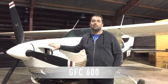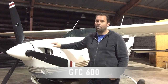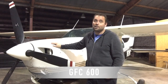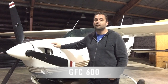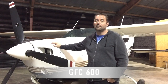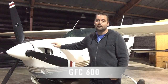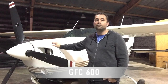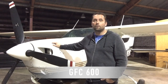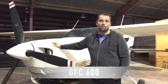The Garmin GFC 600 is their flagship product in the retrofit autopilot market and it brings everything we talked about in the GFC 500 and more. It can fly all the approaches we just talked about and it can also fly the back course. Two of the big differences are that the GFC 600 works on a digital data bus — not a CAN bus — and it has its own internal attitude reference, so it doesn't need a G5 as an external reference. Because it works on a digital data bus, it can communicate with other equipment on that bus like a Garmin G500 or G600 PFD. If you've got a G500 or G600 and want a digital autopilot, your choice today is really the Garmin GFC 600 or the STEC 3100.